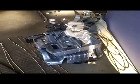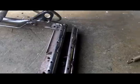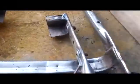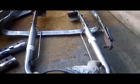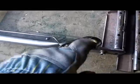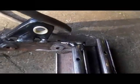Seat number two. There's the original aluminum pieces of crap I didn't want. And there's the bracket for it, just like this one. I even have plenty of material to cut off the end. I have to grind the rivets off here and here. After I figure out the width, which is 16 1/4 between tube to tube. I did it front and rear, so it's 16 1/4 from here to here and here to here. Squares it up nicely, and the brackets that I cut off the original tracks work good. So here we go. Gonna weld a little bit. I'll get my elf to weld if I can get him up from under the bench.